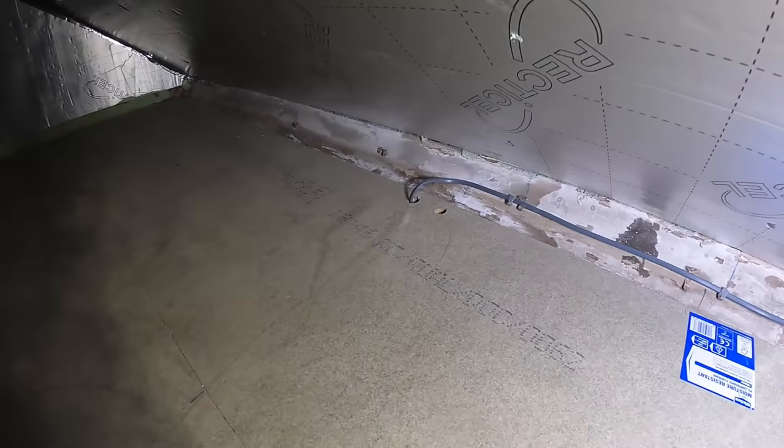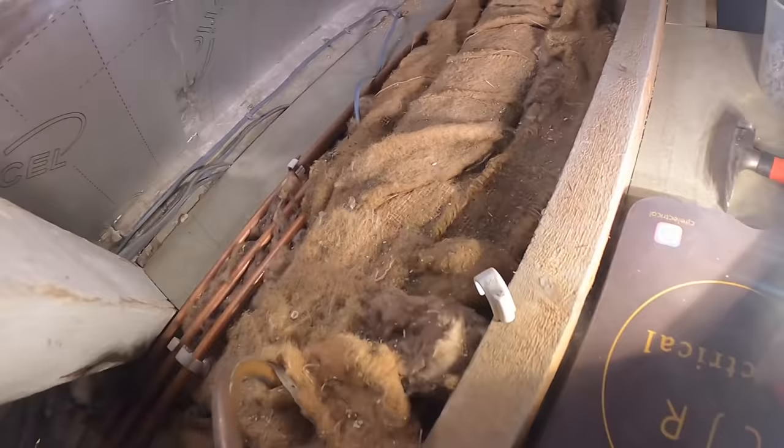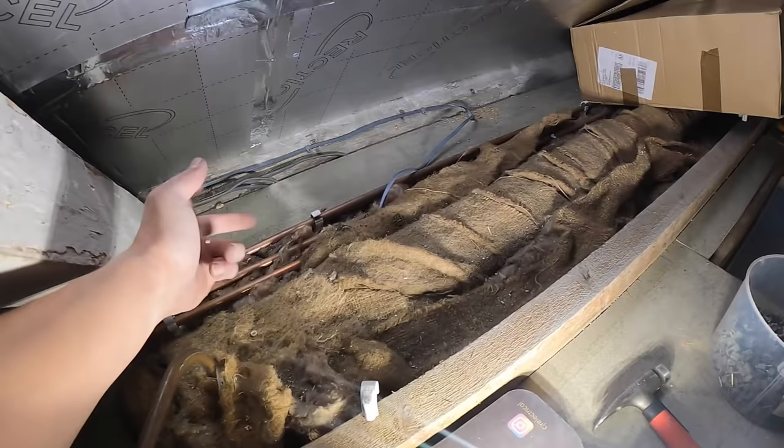Right, so cable goes down to the last light in the corridor. We've then clipped along, he loops down to that light there. These two cables here go to a pendant, we'll pull those out, put them into a Wago box, and that's our last one. I've then pulled another loop of cable, he'll go to that Wago box with those two in. Job's a good one.